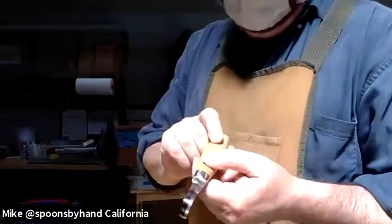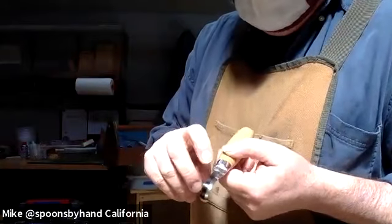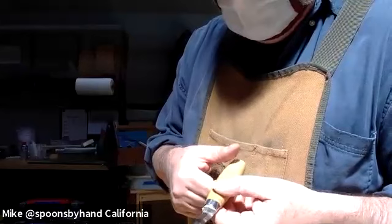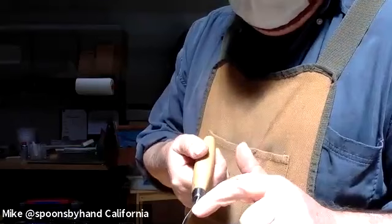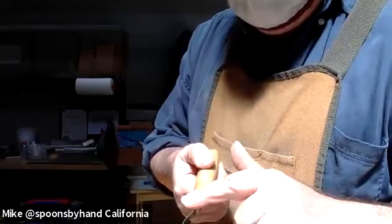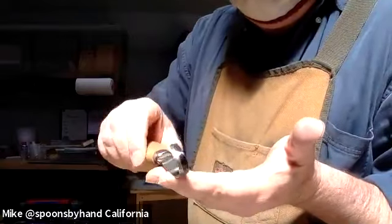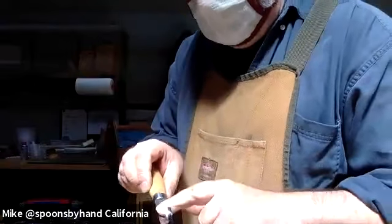Right. So basically, this was two distinct bevels a few minutes ago. Now it's one bevel, slightly curved in some spots, flatter in others. The other thing the new ones do, they have the back here so thin that it's confusing. People think it's another cutting edge, but it just clears off the back so that when you're doing a cut like this, the corner of the back doesn't hit so much. So I can already feel a strong burr on the inside.